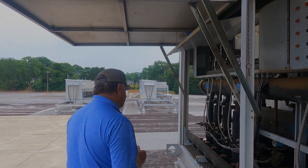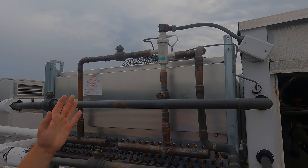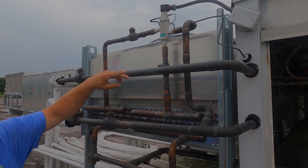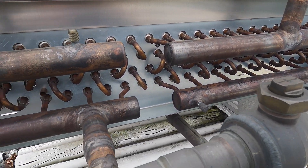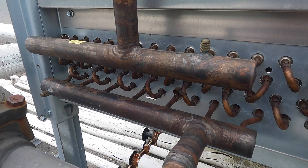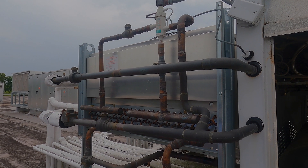That device right there is our three-way split valve. The three-way split valve will energize and essentially cut this condenser in half. Now I'm only sending discharge gas to this half of the condenser instead of both sides. On this three-way valve, both sides are going to flow, or only one side is going to flow.